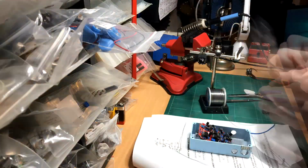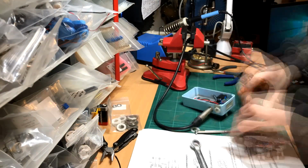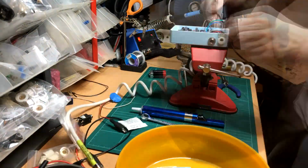Once you're done soldering everything up, there's only one thing left to do. There's an internal trim pot to bias the Pork Barrel. It takes about a minute to listen in and find the point where you have the maximum amount of chorus effect without distorting. And after that, she's ready to go. There's not a lot of afterwards fiddling needed there.